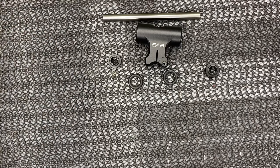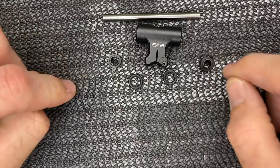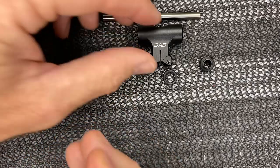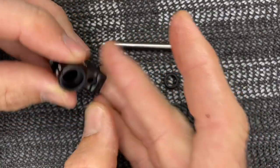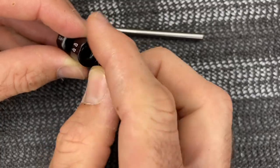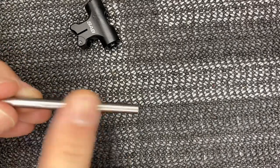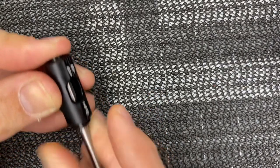Linkages are done at 44 millimeters. Next step is the head block itself. Open your head block — you'll have your o-rings and hard dampeners. Use a little bit of micro lube on your finger, lube up the o-rings, and insert one into the head. Get a little micro lube on the dampener and insert it. Do the same on both sides. Then put a tiny bit of micro lube on the actual shaft and insert it.